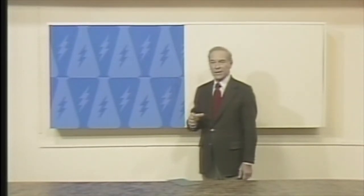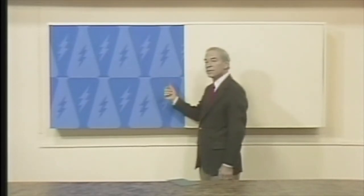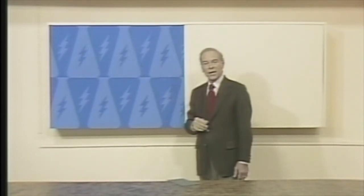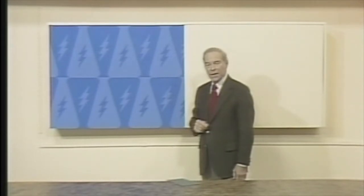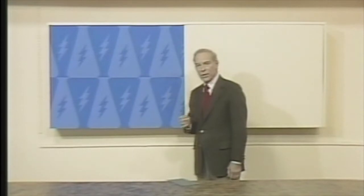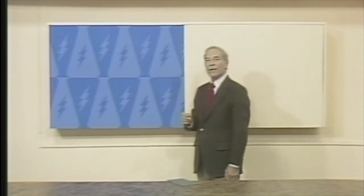Chroma means color, and the TV camera sees all the colors in the scene. Notice the color blue — it generates an electronic signal in the camera that is processed and eventually reproduces an identical blue on your TV screen. The equipment can be set up so that the color blue becomes a key or switch that turns off the picture, producing a black hole wherever the camera sees blue.